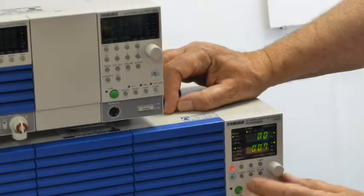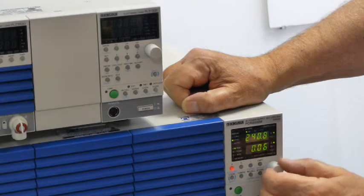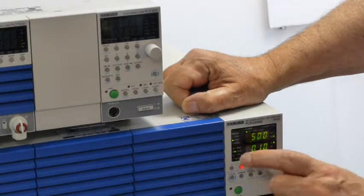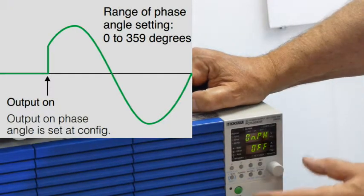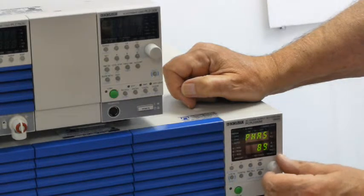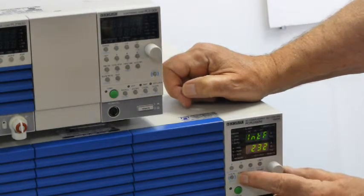We're going to set this unit up now. We need the 270 volt range because this unit is 230 volts. The voltage we're going to set: 230. Frequency — you can vary that, we have quite a range, but we're in the UK so we'll say 50. For the current, we want the peak recorded. Now we need to configure the phase — the point at which the mains cycle crosses through zero. We're going to say we need that to happen at 90 degrees, because I think that's around the highest point for the inrush current. That's set. The time the display figure is shown is set at short here, that's about less than a second — we'll make it long, which is five seconds. Other configuration is all okay.